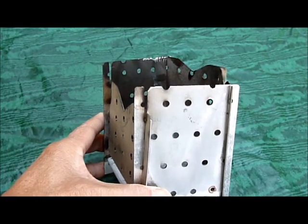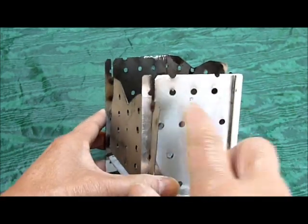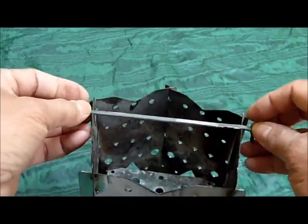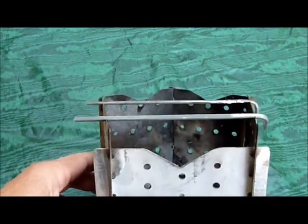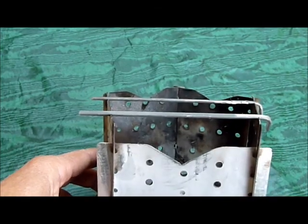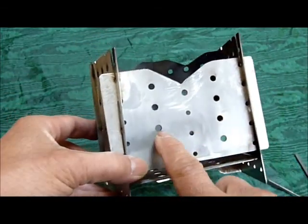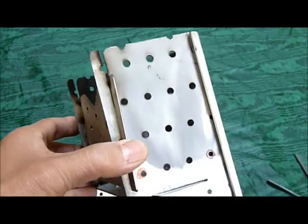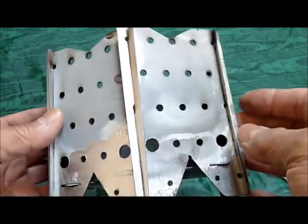The side plates are basically unchanged except for the 2 little notches at the very top. And here, they are used to support the rod or maybe a future grill plate and provide me with a little bit more clearance for the top feed port. Finally, I enlarged all the existing holes to 3/16 inch diameter to accommodate my specific support rod that I'm using to feed my situation. Basically, that's it for all the changes.